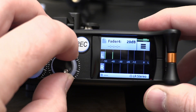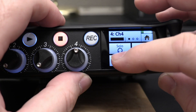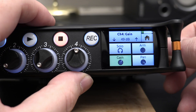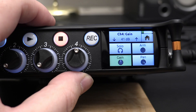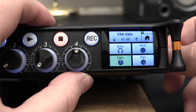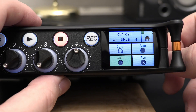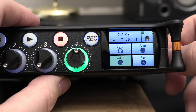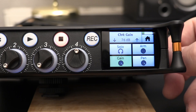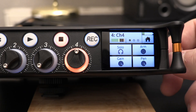It seems a little less than ideal when you first use advanced mode because you can't actually see the recording levels on the screen while changing the gain. But if you look at the LEDs on the pots, they take over at that point and change color in an equivalent range to what it would be on the screen. When unlit, gain is too low; then it starts flickering green, then steady full green, then orange when peaking. So you put the gain up to just where it starts to peak and back it off a bit, then adjust with the fader.